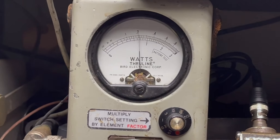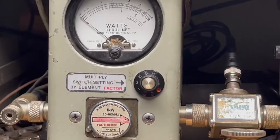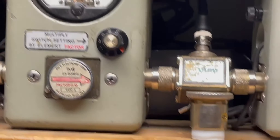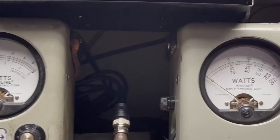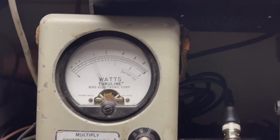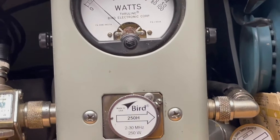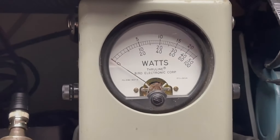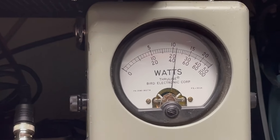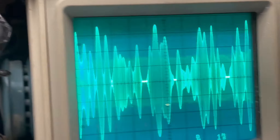The end result on the tune-up: on a 10-to-1 scale with power turned all the way down, we set it for 2. When I turn it all the way up, it hits 20 on the meter. With a 250 slug, that's 100 watts right there. On audio, it peaks around 125 watts modulated. Sideband audio checks out as well.